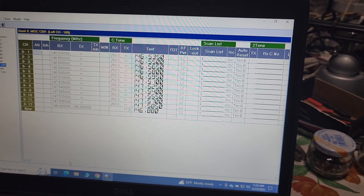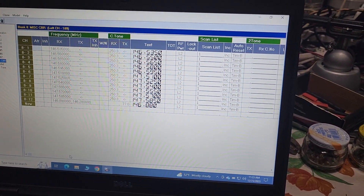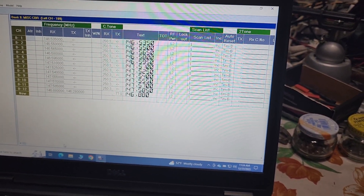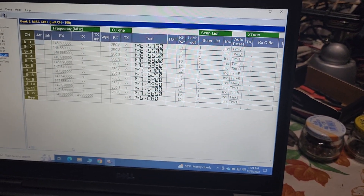So if we ever needed to use it — the other thing we did is we turned off the tone decode on the 2 meter just to let the repeater bring it up. Now we could turn it back on, it wouldn't be a big deal. Because of what we've done with the handhelds now, just no tone squelch on the handhelds and all of this just works.